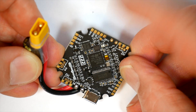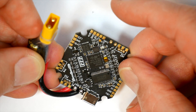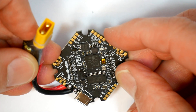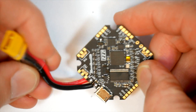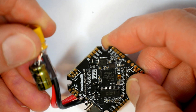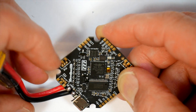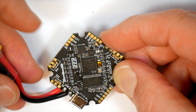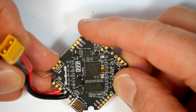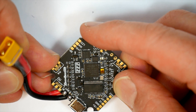It's an STM32 F411-based flight controller with an MPU-6000 gyro, and you can run it off two to four S lipos. The battery wires and the XT60 are already soldered and have a low ESR capacitor fitted, though this needs to be at the other end of the wire to really work at suppressing noise. The mounting points are in the corners on a 26.5mm pitch, so it's just like a CrazyBee fit — it may just drop in.